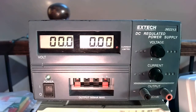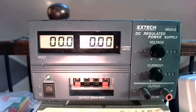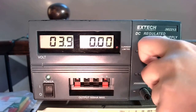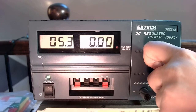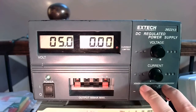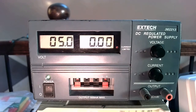The voltage knob is what we use to control the voltage. This is a constant voltage power supply, so this is the main dial that I use. It is a very light touch — it does not take a lot of force to increase the voltage, and it doesn't take much to really change that value. The first time you use this, I would recommend having it unplugged while you increase the voltage, because it's very easy to overshoot your mark. If you accidentally overshoot, especially in digital systems, you could damage the components on your breadboard.